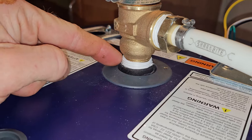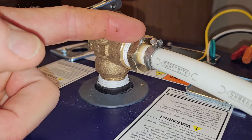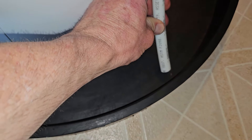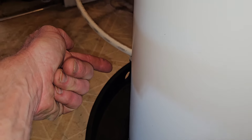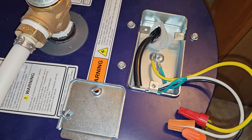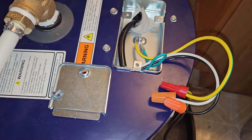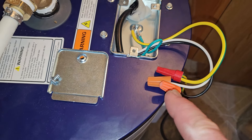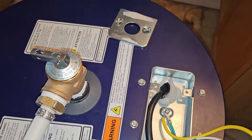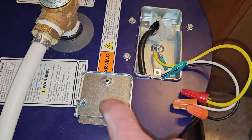Same thing — three-quarter inch to half inch — and then I used PEX coming down here with a 90-degree bend for runoff and pressure relief water, just in case, going into the drain pan so it drains out in that area. These connections from the factory are nicely sealed shut. Here's your drain plug, and this is your heating rod again like we saw in the diagram. I do have a drain pan below it for the purposes of this video — you'd want a drain connected here or PEX draining out of your house.